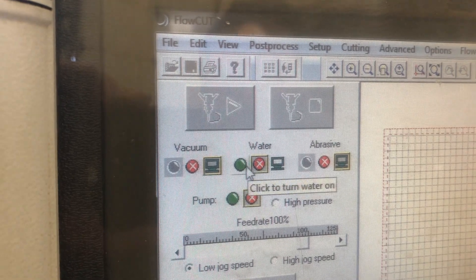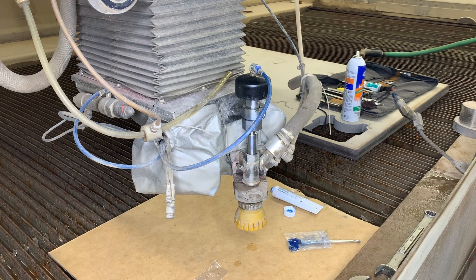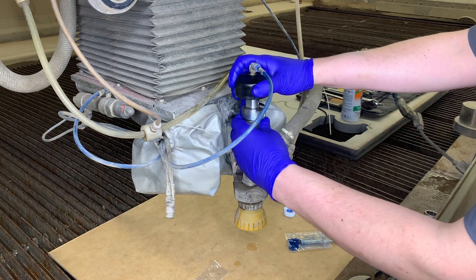At this point, go back over to the controller and turn the water on — in other words, turn the cutting head to the on position. We turn the cutting head to the on position because as we tighten the valve body down, we don't want to mash the needle into the seat and rotate it 360 degrees. By turning the cutting head to the on position, we release any pressure that has been placed onto the needle.